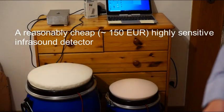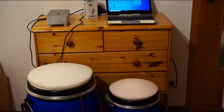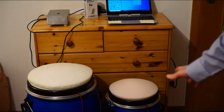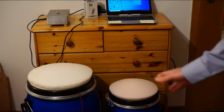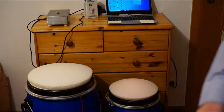Hello. In this video I would like to present you a highly sensitive microphone for detecting infrasound signals. The setup is inspired by work done by Oona Raizanen, who uploaded a video to YouTube entitled 'Low-Frequency Exploration Microphone.' Basically it's the same idea, just in a refined version. She used a loudspeaker as a microphone and combined it with an audio amplifier.